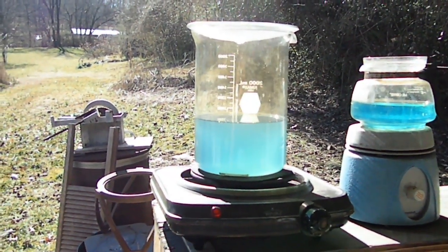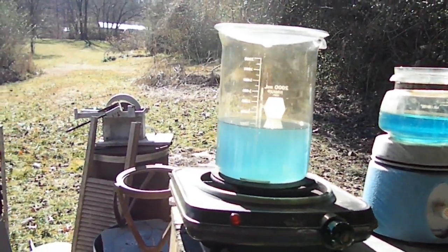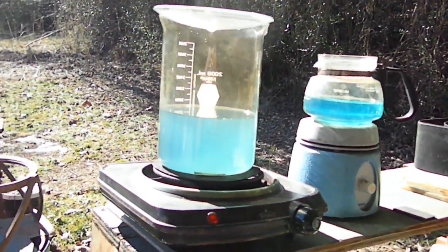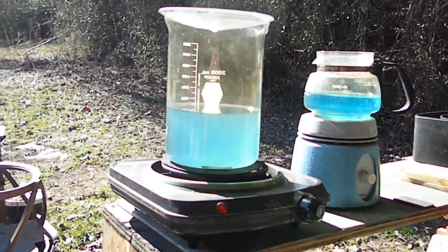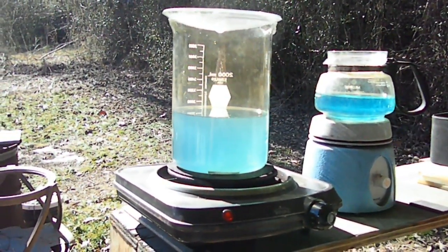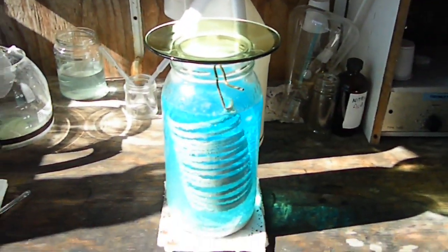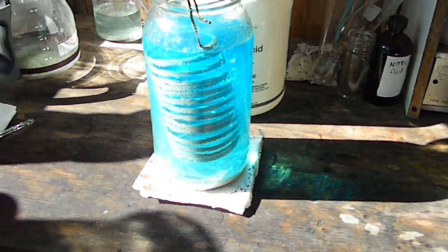I actually put a half of a round in there, weighed it out to add to it to use up the nitric, so that is actually my silver that I'll take back out at the beginning when this is dry before we do our weight on it, because I want the nitric spent. This is batch one, currently dropping.